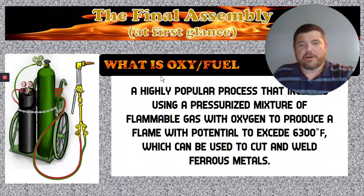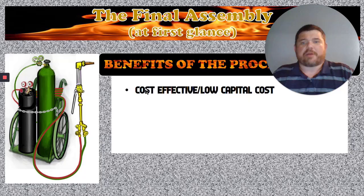So you can imagine it's going to cut through that pretty easily, depending on how thick the metal is. And we are talking about ferrous metals here, which are magnetic — mild steel or a low alloy type of steel. Anything that's not magnetic or non-ferrous, like aluminum or stainless, we're not going to cut with a torch. It doesn't react well.